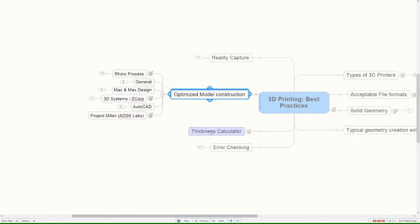It's just 1 over 4, 1/4 inch equals a foot. You multiply that by 1 over 100. You move your decimal places, and you figure out what the scale factor would be. So we can use that also to figure out what's the thinnest piece, like railings and balusters, and sometimes there are wires or cables and things. So you have to figure out, I really don't want that 3D printed anyway. It would be too small. I can use different technology or different materials for that.